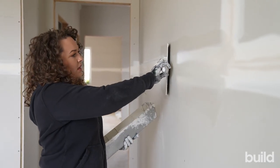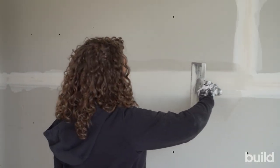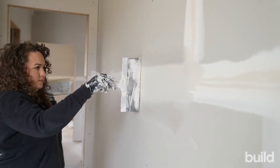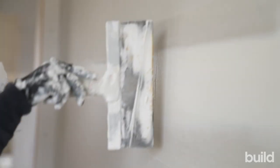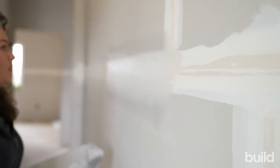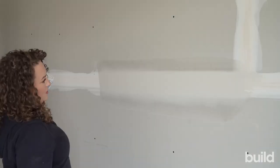Then I'll take my knife and run straight across, and I'm going to do it again. When I put this up you can tell it's full. This is actually a little over right now — there's a big line right there, my mud is sticking up too far and too far out of that joint. So that's why it's really important that you're checking as you go. I'm going to go ahead and pass over it again, a little bit tighter this time, and then we'll check it. That looks really good — there's barely anything that's not over, it allows for some shrinkage.